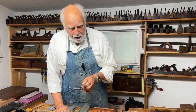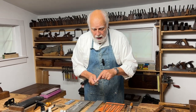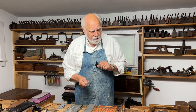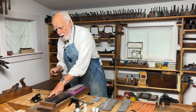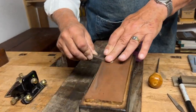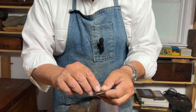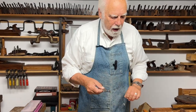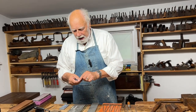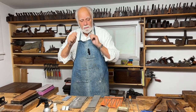The next thing, true for almost every sharpening item you're working on, is to keep the back of the iron perfectly flat. So if I had filed this profile to match the back of the plane, the first thing I would do would be to put it on whatever sharpening stone I wanted and make sure the back of the iron was perfectly flat. By using different kinds of files to make the bevel equal, that's all you have to do — because the cutting edge is simply where the back intersects with the front.